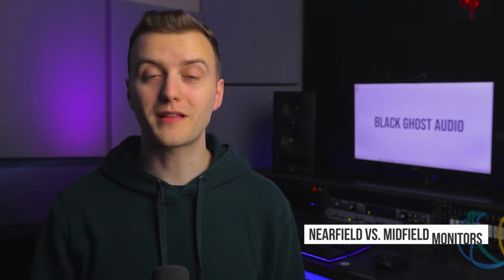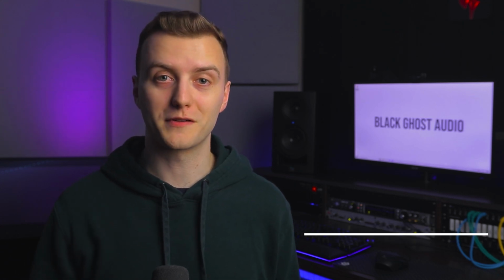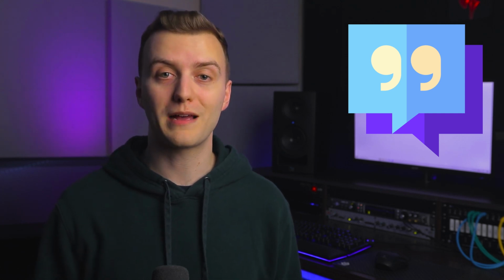Studio monitors are usually classified as either near field or midfield. Near-field monitors are more suited for small studios, whereas mid-field monitors are more suited for large studios. In his article titled Near-Field vs. Mid-Field Monitors, Which is Right for You?, Phil O'Keefe of Harmony Central mentions that near-field monitoring is a good choice for those working in smaller rooms or rooms with more challenging acoustics. While they won't completely eliminate the effect of room acoustics on what you hear, they will help minimize related issues, especially if you keep your playback levels reasonable.